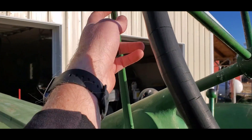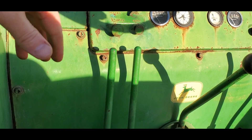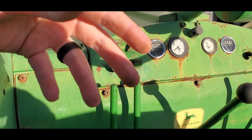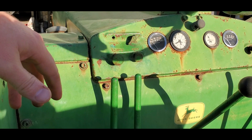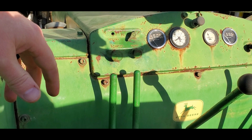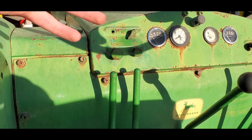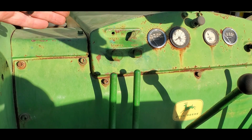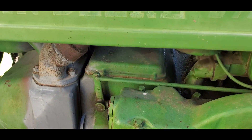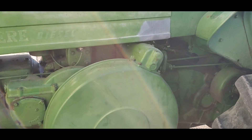However, there will not be any fuel because the throttle is still off. We'll let that turn over for as long as we want. If it's warm outside, we won't need to let it turn over as long. But if it's cold outside, we'll let it turn over a little bit longer because that compressing of that air inside the engine will begin to heat up the engine combustion chamber. The longer we let that heat up, the better. Keep in mind, all this time the pony motor is running and it's warming up the air that's coming in. As long as we can get this diesel engine as warm as we can, that will help it start. We have no glow plugs, nothing like that to help warm the engine.